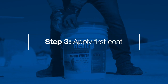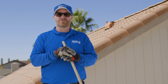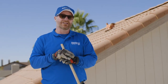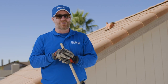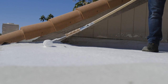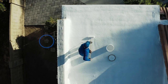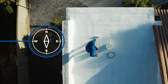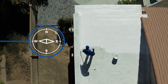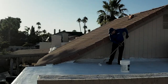Now we're ready to apply the first coat of Henry Envirowhite. It is ready to use and should not be thinned. Make sure you mix it well before use, and apply it to a warm roof — but not too hot to touch. Apply coatings evenly, taking long light strokes in one direction, going north and south or east and west. Apply the second coat at a right angle to the first coat — so if you went north and south the first time, go east and west the second. Schedule your work so that the coating has two hours to dry before nightfall.